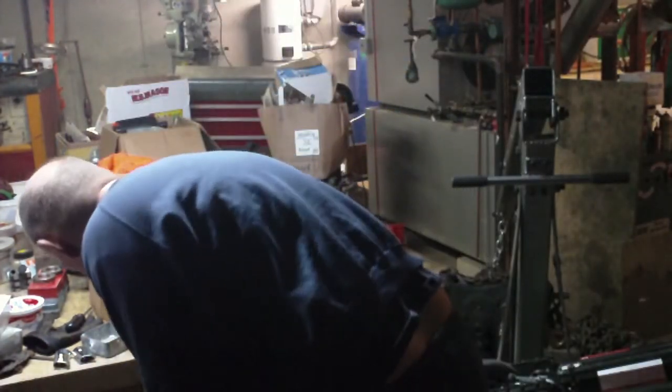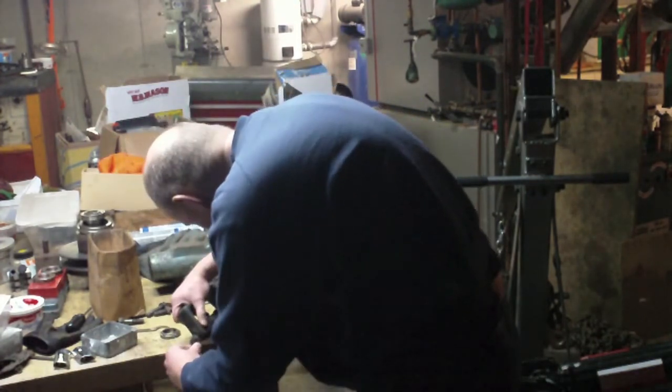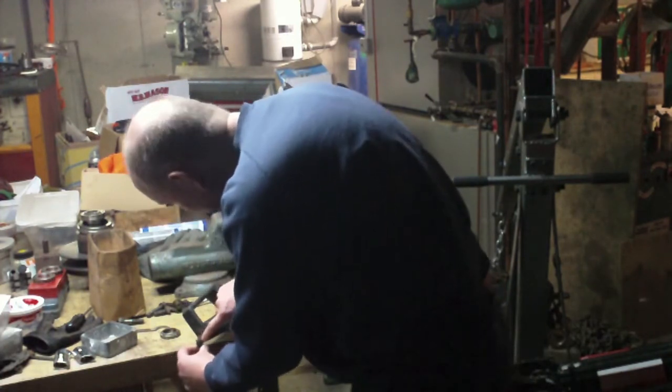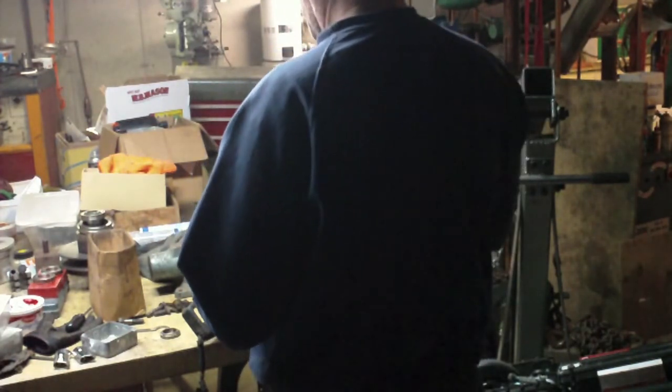Alright, camera back on the tripod so we can get in on the action here live. I'm looking at this wire coming out right where it comes out here. The neutral wire, the copper, is completely exposed. The ground wire and the black, the hot lead, look like they might still have some insulation on it, so there's a chance that I might be able to actually plug this in without it blowing the circuit breaker.